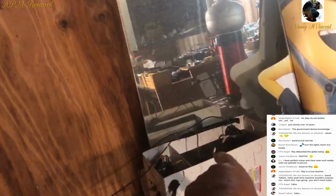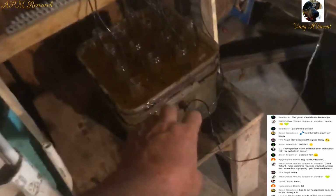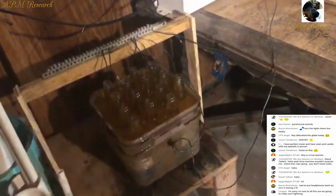We're coming out of that. This is a center tapped, coming off of 2 sides. So when one side's positive, the other side's negative. Then they rotate: positive, negative, negative, positive. So that means both ends of the wire going in the bottle, and the wire that's in a bolt going through the plastic, are in the salt water. There's salt water in the bottle, and I got oil on top of the water and oil on top of the bottle, inside the bottle, so there's no breakout.